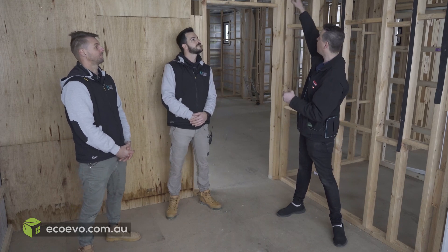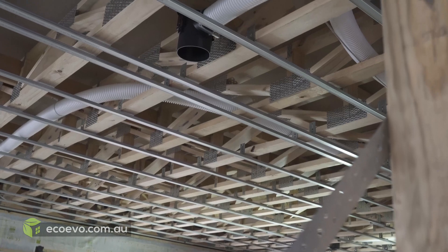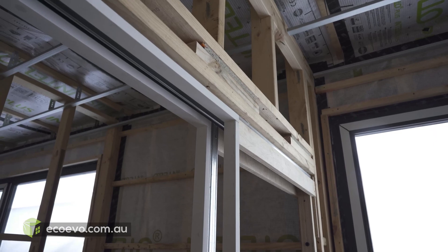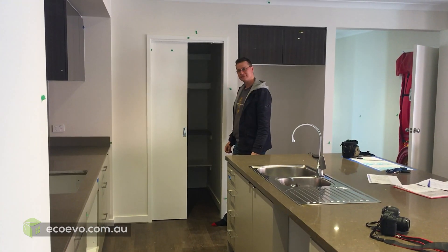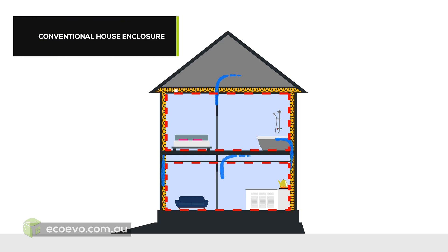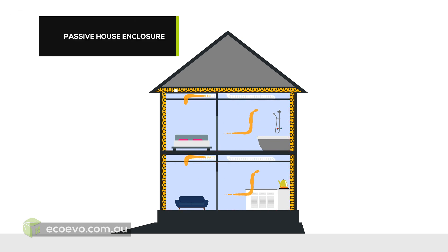One of the clear differences that stands out compared to commonly built homes in Australia is that all the internal walls on the top floor have an air barrier passing straight over them. So all your internal cavity sliders and anything in these internal walls are not leaking directly to the outside — it's a massive difference. A cavity slider like that is all just fit-out really, there's no structural element to it. It is a completely different style.